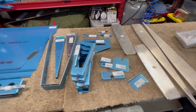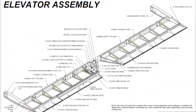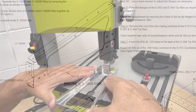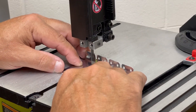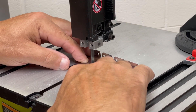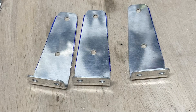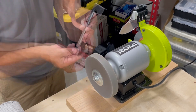The process of converting these parts into an aircraft elevator begins with the creation of a dozen internal ribs to support the airfoil. The two halves of the ribs are separated using a bandsaw. I'll do the same to turn this single stamped piece of aluminum into three shear clips, and then spend a lot of time shaping and deburring the edges of all of them.